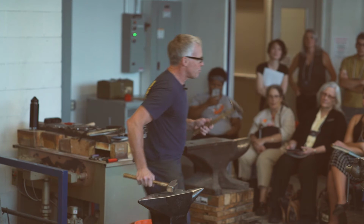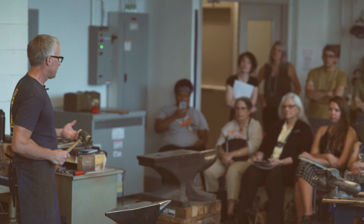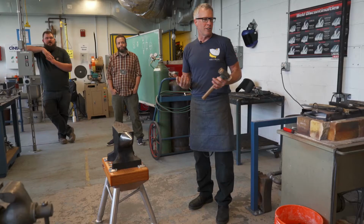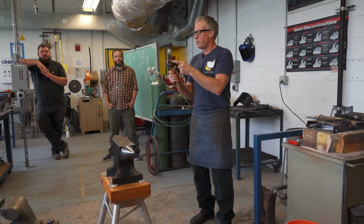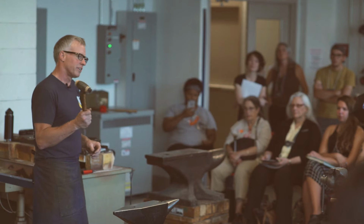Another hammer that I use a lot are these. When I make all this cool texture, I don't want to smash it with a steel hammer and smash all that great texture that I worked so hard to put in there. So I use these. This is a rawhide, which smells terrible when you hit hot stuff with it, but it doesn't ding up your surface. And if you use a straight rawhide mallet, they don't weigh anything. So this is cast iron. These things are expensive new, but they're almost always at a flea market someplace for cheap. And I found that for some of these, instead of buying the inserts, I just buy a rawhide mallet and cut it in half, because the rawhide mallet is actually cheaper than these inserts. And this is a little one. They make these in much bigger sizes, but I didn't want to carry that, so I brought this one.